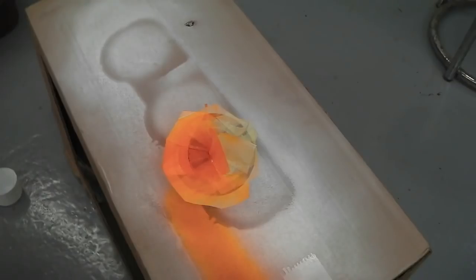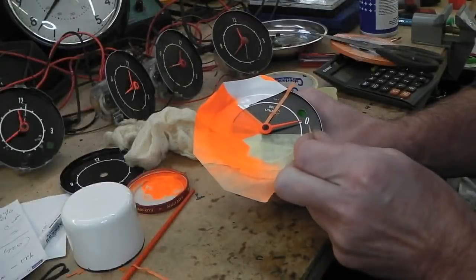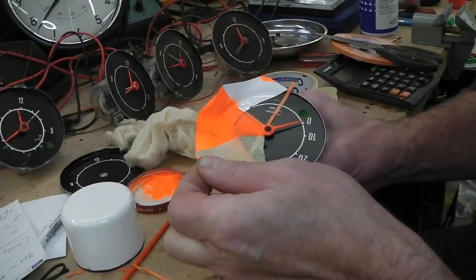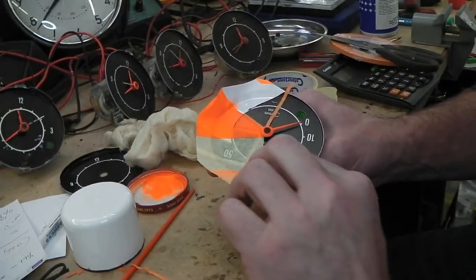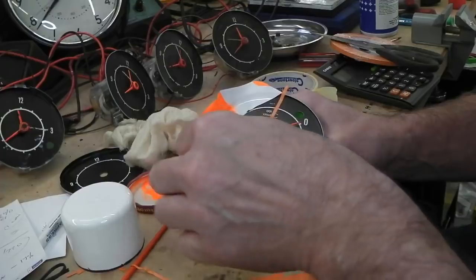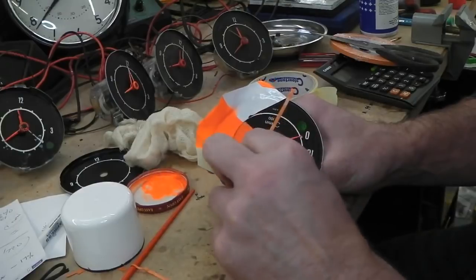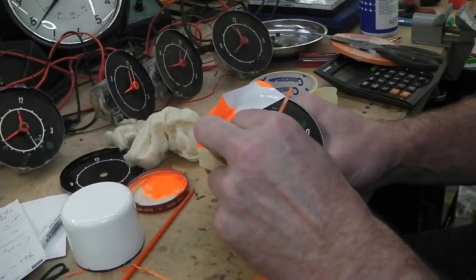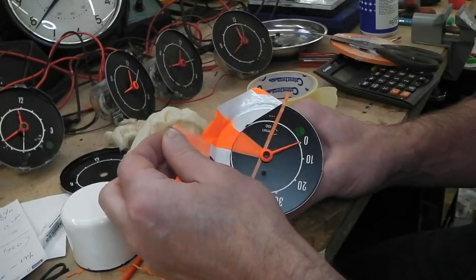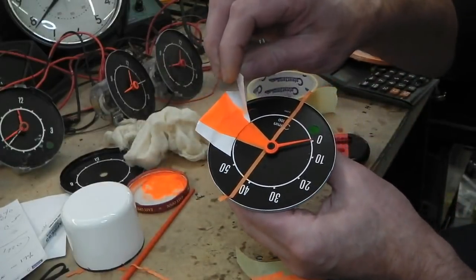We'll leave that for a few minutes and we'll unveil. Right, let's see how we turned out. Carefully, because we've got the gauge. Careful, because we're hoping the paint remains untouched on the face of the instrument. And I don't want to suddenly let the tape let go and then my hand run into the needle and damage the needle, so work backwards once we've got that. There we are, we've got it away from the needle, out, and then the white, not quite masking tape.